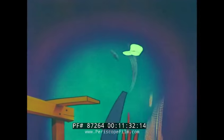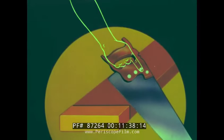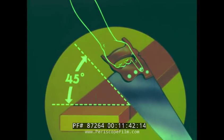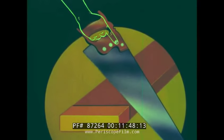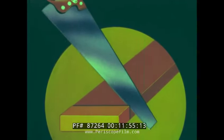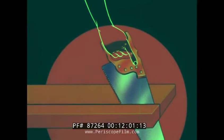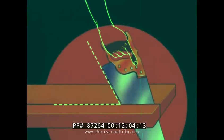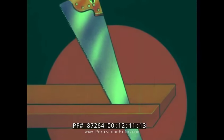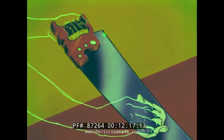That's better — see how nice and clean that cut-off is? When using the crosscut saw, hold the saw at a 45-degree angle to the board, and always start the cut with a backstroke. Holding the index finger along the handle helps to saw straight along the line. For sawing with the grain, use the rip saw — hold it at an angle of 60 degrees to the wood, use long steady strokes, and don't force the saw. After every use, rub a little oil on the blade to guard against rust.